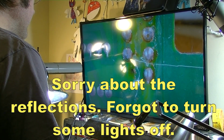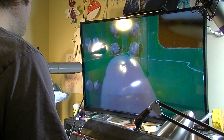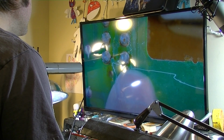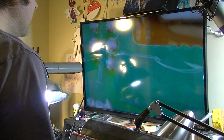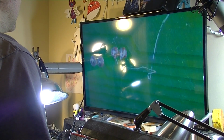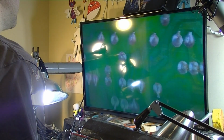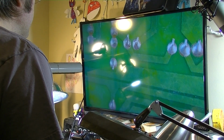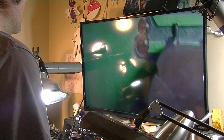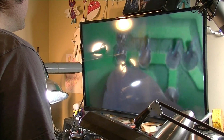Now, these right here look particularly crusty, and I was kind of worried about this big scratch running across here. I'm not sure, I don't think it's severed that connection, but something sure got in here and scratched the hell out of it. I don't think it severed anything. Yeah, this really isn't the board that I suspect is the problem anyway. And that one though looks like it has a cracked joint. So I'll reflow that one for sure.